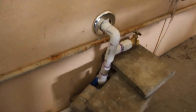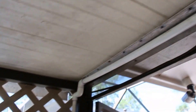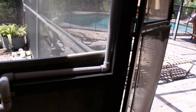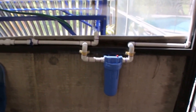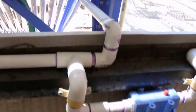Here's the plumbing and here's where I tap my cold water. I've got a valve so I can shut the system off from the rest of the house. I run it all the way across and up the wall — here's my PVC piping with a couple of 90-degree bends, neatly tucked away. Ultimately I go into a sediment filter, which I use because I'm on a well.